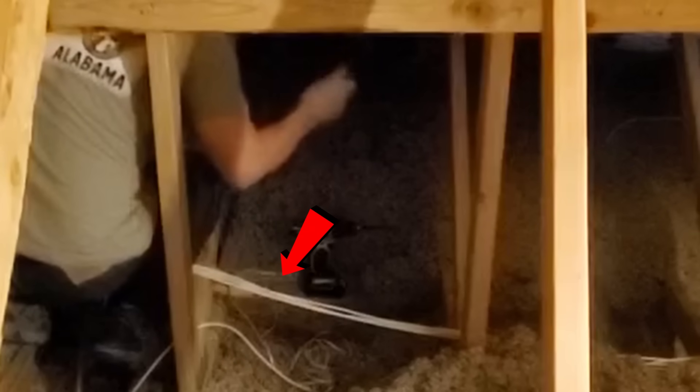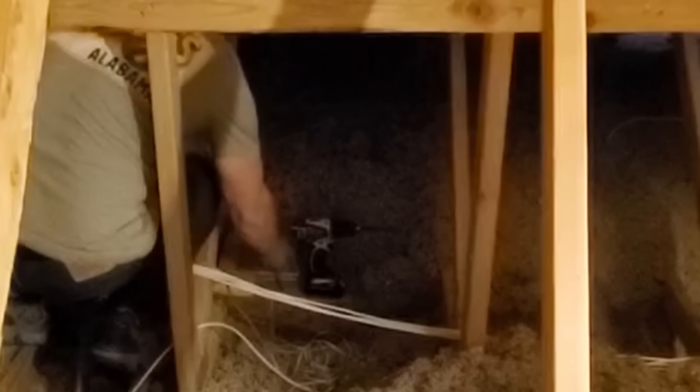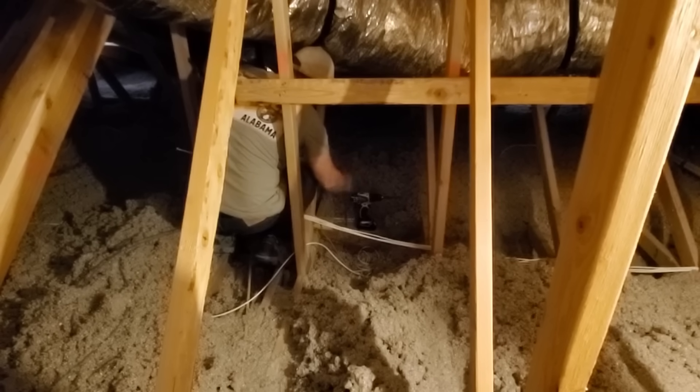Right here is the location of the hole, and simply start fishing the wire through the hole. As you feed the wire down the cavity of the wall, you want to keep feeding that wire until you feel it hit the bottom of the floor. Once you hit the bottom, stop feeding the wire.